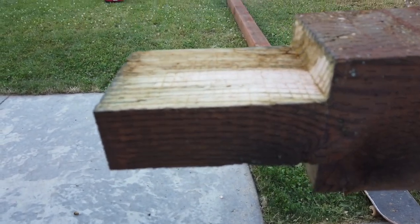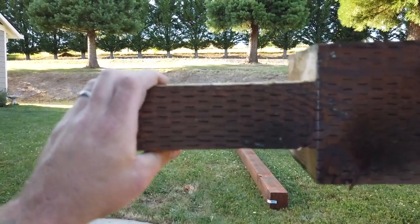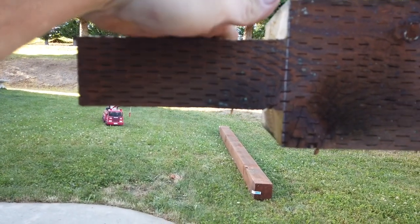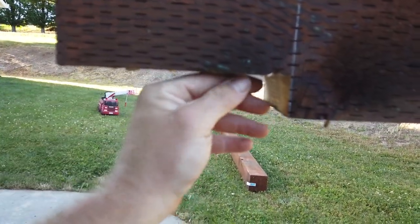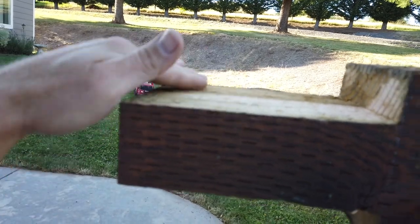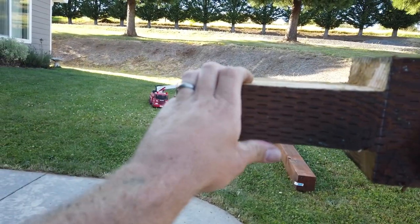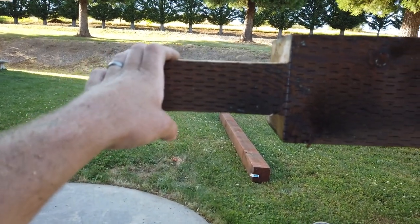Here's what you end up with. You notch both sides for an inch and a half so that you can put a two-by-eight here and two-by-eight here. I just cleaned it up with a chisel and that's it. So these are done for now — we're going to move on to the decorative headers.